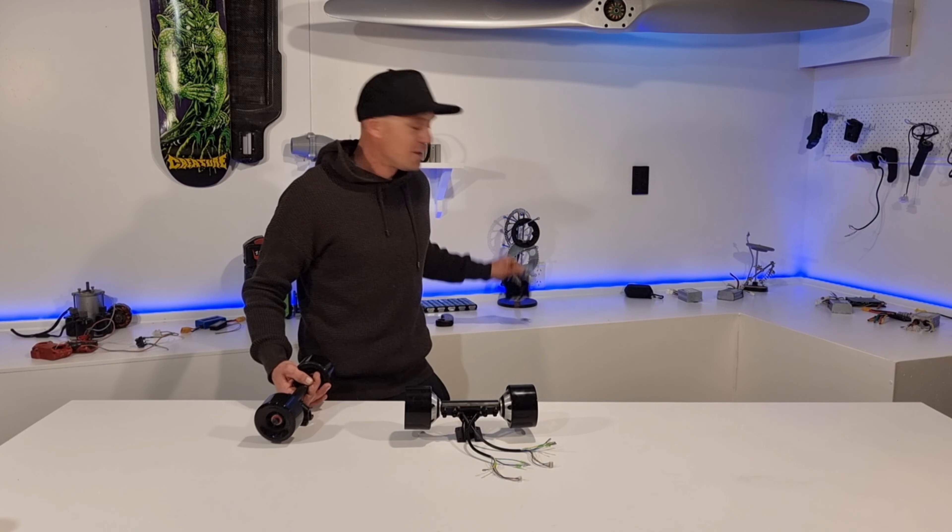While we're waiting for our battery box to get made, we're just going to pre-tin our BMS and all of our wires. I'm using an XT60 because that's what came with the speed controller, and I've pre-mounted the XT60. I find it a little bit safer mounting it before you have it connected to the battery — obviously the wires are live so they're a lot more dangerous. XT90s are harder, but XT60s are even smaller so pretty hard to mount. We're using 12 gauge wire, which is about the biggest you can fit in there.